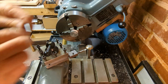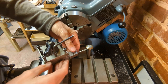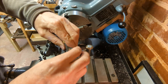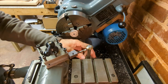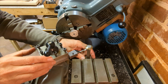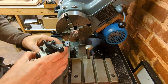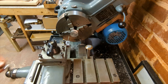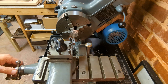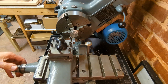I think there are still quite a few folk who, like me, don't have a quick change tool post. If you get yourself organised and have suitable packing, then you can get by. So I use this height gauge here, and I've just set this up slightly above center height since I'm boring a small hole. That's one way to make sure that you've got adequate front clearance. If you're just slightly below center line or on center line, it makes that front clearance in a hole a little bit difficult because of the curvature.